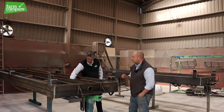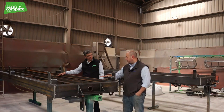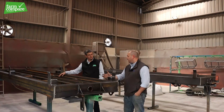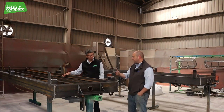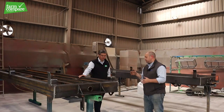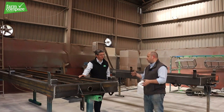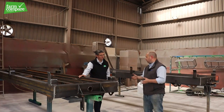On the 10-ton it's a greased 50mm pin, and then whenever you cross from the 10-ton to the 12, it's an 80mm grease pin because the same structure and frame does the 12, 14, and 16-ton trailers — so you're into a different animal. Getting back to the 10-ton, we know this trailer is well fit for 12.5 to 13 ton. It can carry it, it can tip it, and it can do so safely.